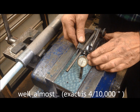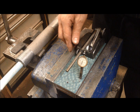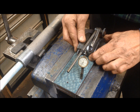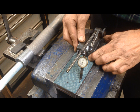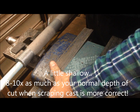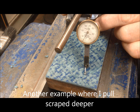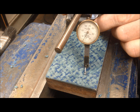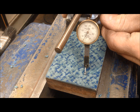And one hundredth of a millimeter is half a thousandth. So with the regular surface rough scrape without Rulon, half a thou is okay. But on this, you get three to four times that. And pressing harder you get even more.